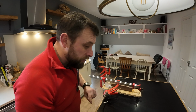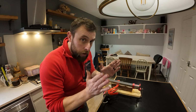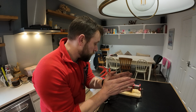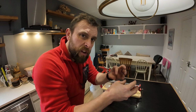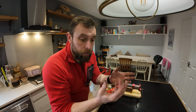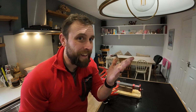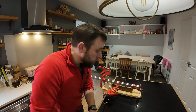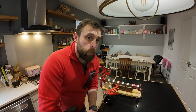But down here in the background, you can see I've got the handle cut out from the walnut. And I've just glued two bits of ash at a bit of an angle. So when I grind and cut out the bottom of the actual handle, it's going to have two little accents of ash, hopefully, which will correspond and match with the knife. That's the plan, anyway. So, yeah, just letting that go off now, and then we'll try and start shaping it up. So that's where we're at.